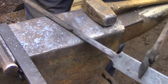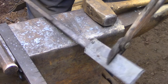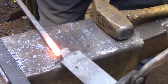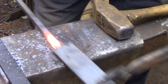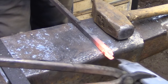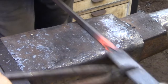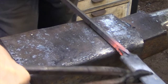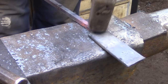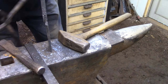You can see here how the two pieces are going to be fitted together. To finish setting up the weld I need to forge the end of the handle tightly around the blade material. So I'm driving the blade back into the handle so it fits very tightly into the bottom of the notch, and then I'm going to forge the two sides of the split up against the blade so that it's as tight as possible.